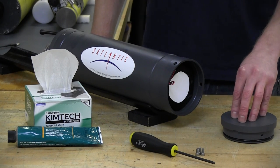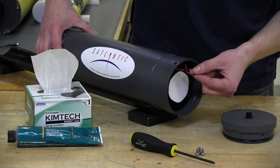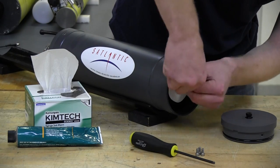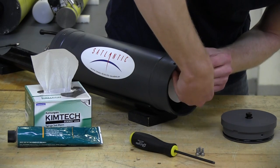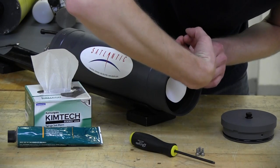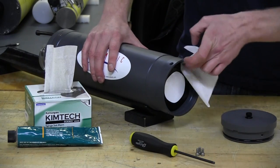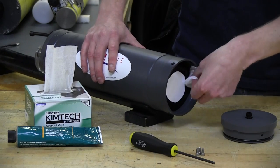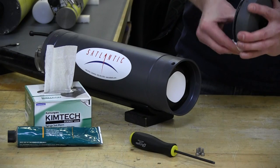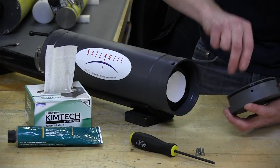Before installing the end cap, which is our final step, we're going to take one last look around to make sure everything is okay. In this case, we happen to have the conductors for the battery exposed past the O-ring surface — you can't have that. You're going to want to really tuck those back in, because if you don't, you run the risk of pinching them or, worse, shearing them when you go to install the end cap. This is also one last opportunity to make sure the O-ring surface and the O-ring itself are clear of any debris. Do a visual check — make sure there are no cuts or slices in it, and that nothing is resting across it. Anything as small as an eyelash resting across it can allow a path for water.